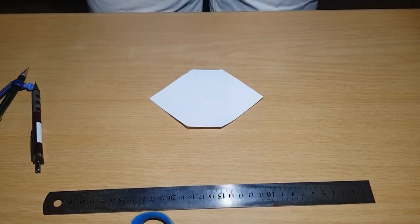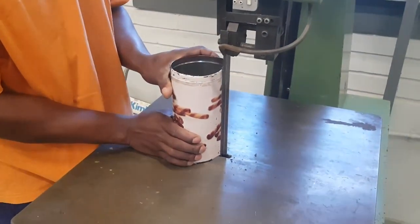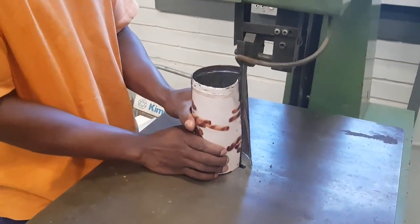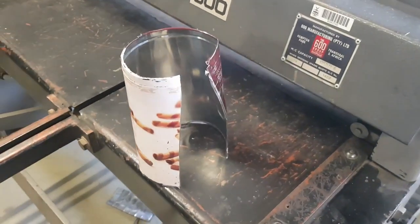The next step is to cut the dry produce tin. The bottom of the tin is cut out using a can opener. The resulting cylinder is cut at the seam using a bandsaw. The tin is then flattened as far as possible. A guillotine is then used to cut the antenna from the tin once the dimensions have been transferred from the template.